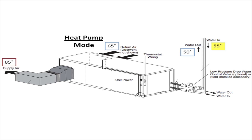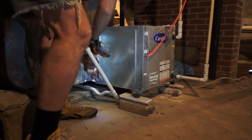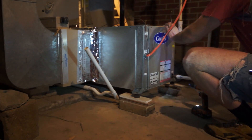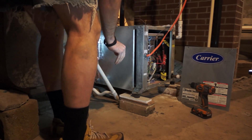Water has a higher thermal density, which makes it much more efficient. Furthermore, the water temperature is very constant year round. Here in Ohio, my groundwater temperature is about 55 degrees. It's a lot easier for a heating system to pull heat from 55-degree water than to try and pull heat from zero-degree air when it's really cold outside. This is a huge advantage for geothermal over an air-sourced heat pump.